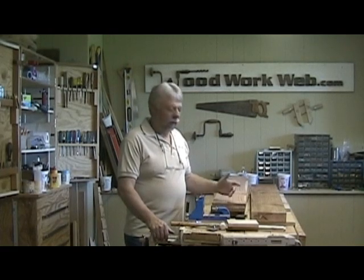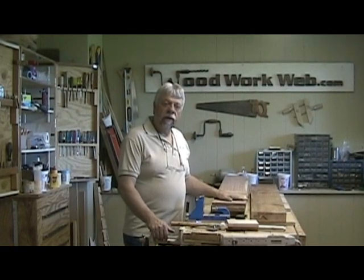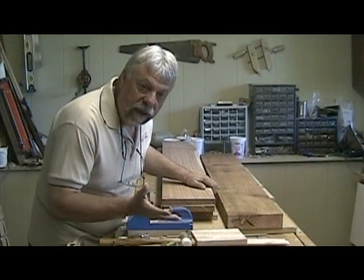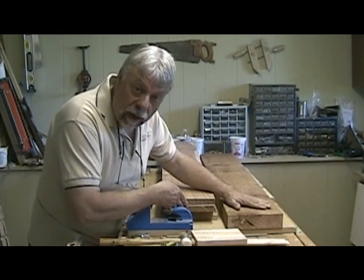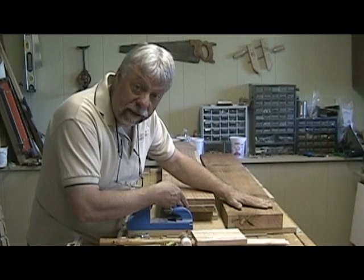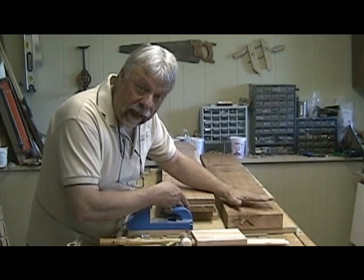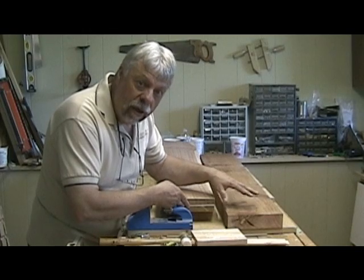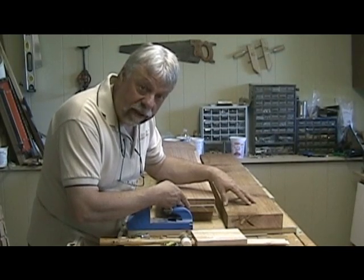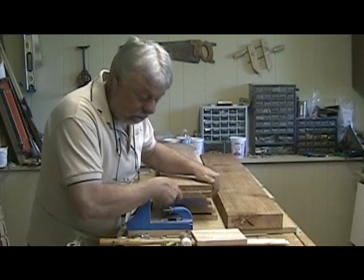I'm just back from the mill now, and we've got a lovely selection of wood. Something called Cedar of Lebanon. I was lucky to pick up some 3/4 inch and some rough cut 2 inch in the same wood. So this is actually going to save me gluing the legs together. That'll save me one step. If you can buy some 2 inch, you too can save that gluing step. Otherwise you'll have to glue 2 3/4 inch pieces together.